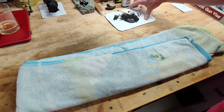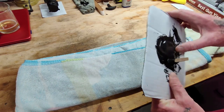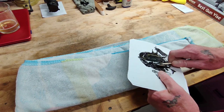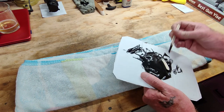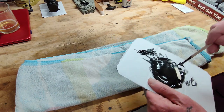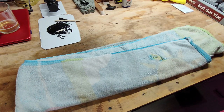Alright, so we're back. One of the things I like to do the most is always keep the epoxy that you mixed up nearby. And then when you think it's cured, you can come back and pull on the popsicle stick and see if it stays in the epoxy. Just check if your epoxy's fully cured. Looks like it is.